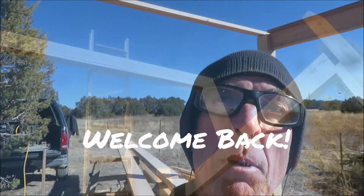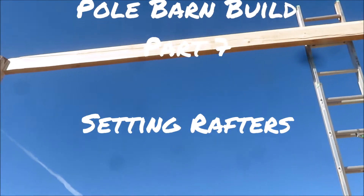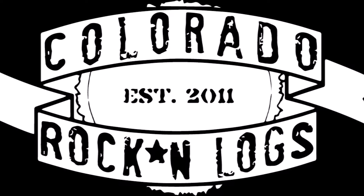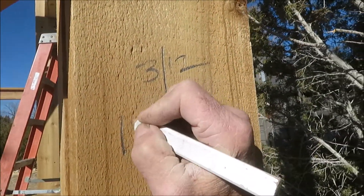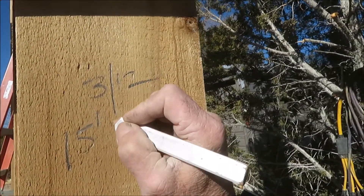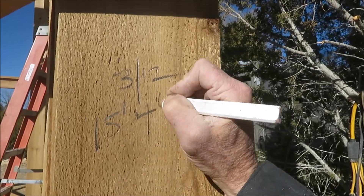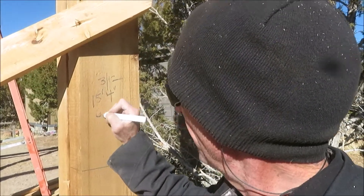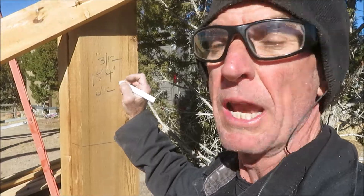It's roof day, time to set some rafters going up. We're setting this roof up on a 3 and 12 pitch, which means it runs three inches up for every 12 inches out. Rafters are going to be 15 foot 4, we're going to need 14 of them, and we're going to set it up with a six and a half inch seat cut.